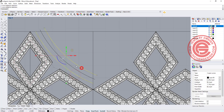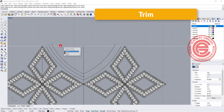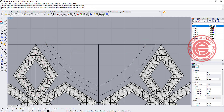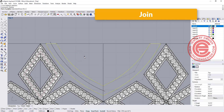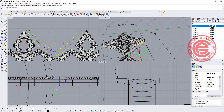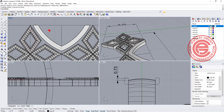To make the shape, I'm going to take those two and mirror to the other side, something like this, and with this cross line we are just going to trim each other. I'm also going to use this curve to trim off the extra on the top and make them into a closed curve — snapping end point to end point here and end point to end point here. Let's go ahead to select all the curves on the border and join them. Once we join them, we can create this thickness by extruding the planar curve straight to the same height as the rest of the design.